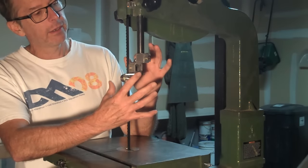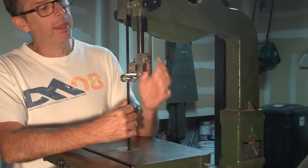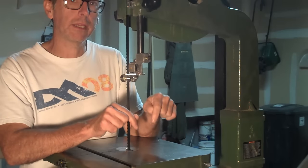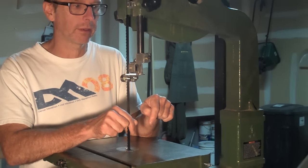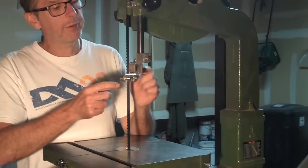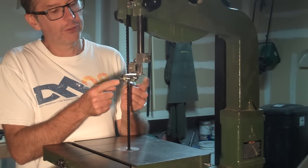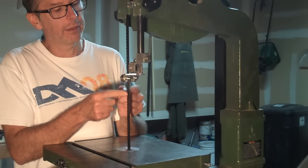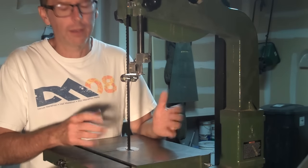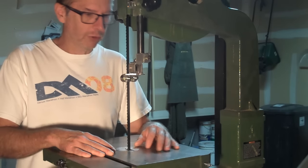I've got a ball bearing guide here on the top, and I bought this from a guy on eBay, and I'll put a link down in the description below if the company is still around. And this thing works pretty well. I did have to modify it so that I could put a total of four, these are just skateboard bearings, on either side of the blade up top here. Down below is just the regular, I use cool blocks, and that seems to work pretty well. So I'll show you how I cut these.